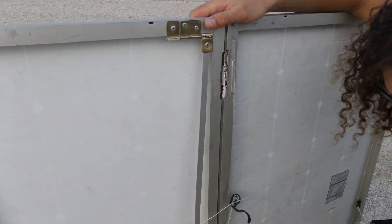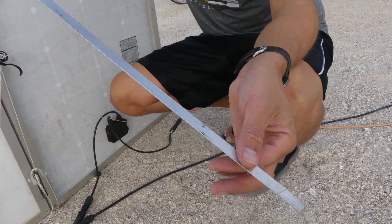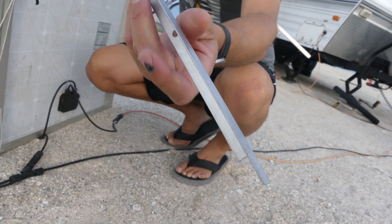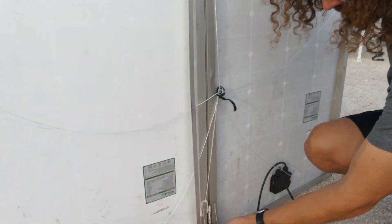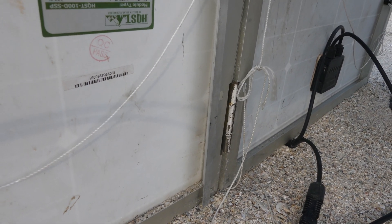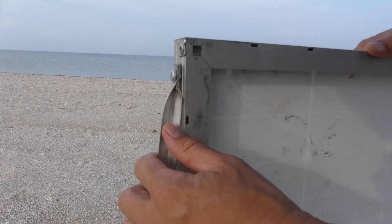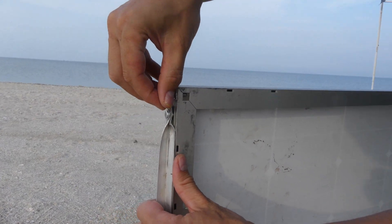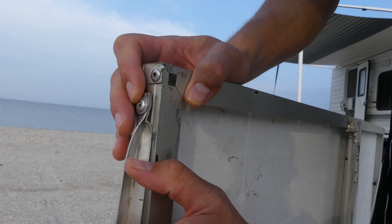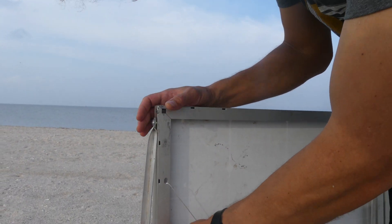The middle leg was the trickiest part. I used a half-inch aluminum L-bracket and used a dremel again to cut off a little of the tip here, so that I could make it go over the lip and that way it isn't going to be banging against the back side while it's traveling. The two on the side — if I did this again I would do it a little bit differently. I squeezed it together and had two layers there but that ended up being a little bit loose, so I would just not bother with that and just rivet it on there.